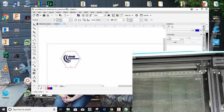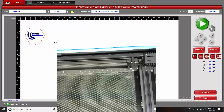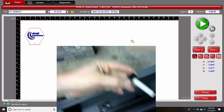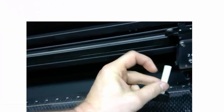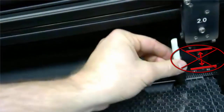Now we want to open up the UCP software. Go ahead and open it up. There are a couple of things we need to know here. First, we need to make sure that our material is two inches from the laser. In order to do this, you'll see this leveling tool right over here — this is for leveling it so the laser is exactly two inches. This little lip right here needs to be right there, so if it's not, we need to raise our bed up until it hits right there.